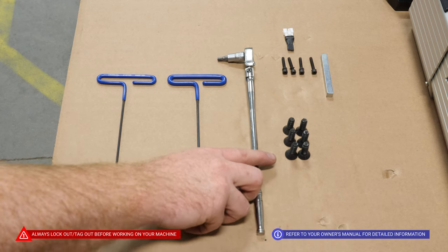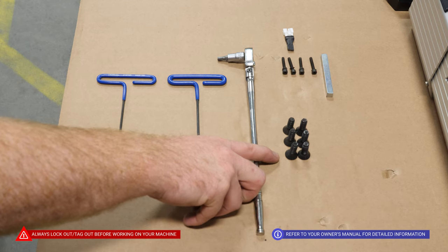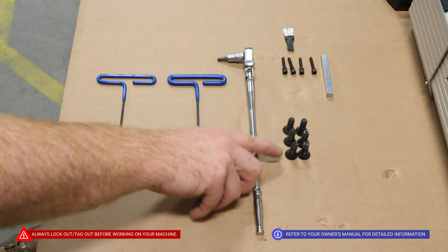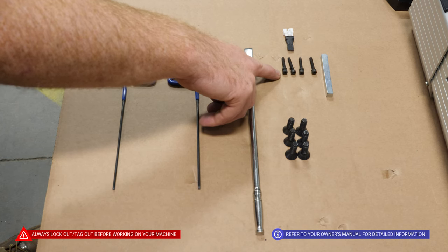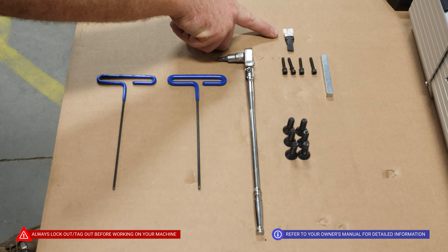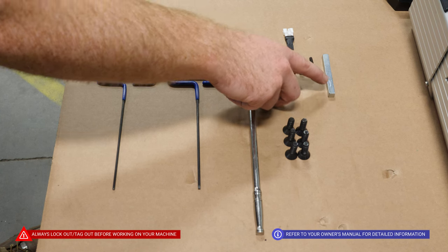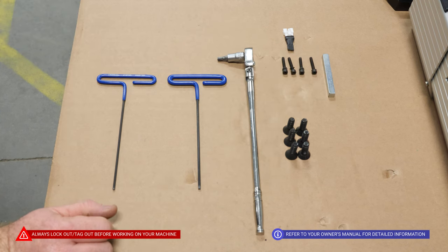The hardware required is six 5/16" National Coarse flatheads, one inch long. This is hardware provided by HSD to mount the cooling plate. This is an electrical connector for the fan override, and this is a piece of 8mm keystock for mounting the motor to the plate.